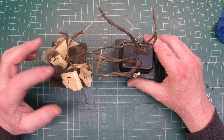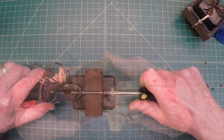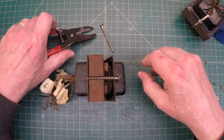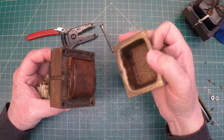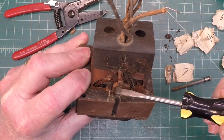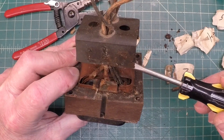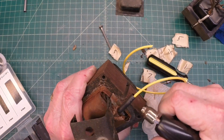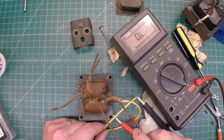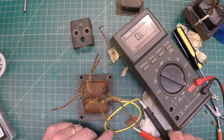I'm going to do some checks offline, just look at DC resistance, and see if either one of these transformers are good. I think I'm in luck here. You guys can probably see that lead here protruding through. I'll see if I can get that dressed up and rerouted up through here, then clean up the rest of these leads. This is now my center-tapped location — it was going to the bell housing itself, in between the laminates and the bell housing, so it was grounded. And you can see I've separated that now.